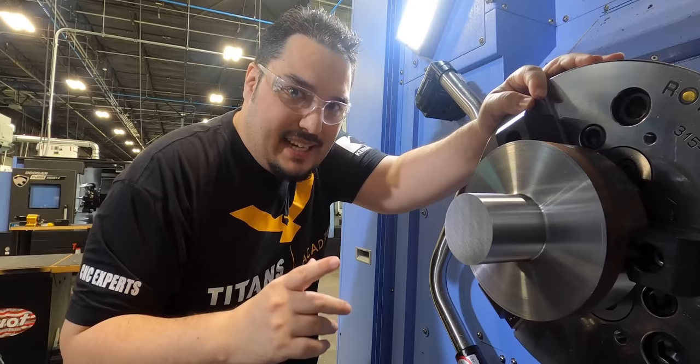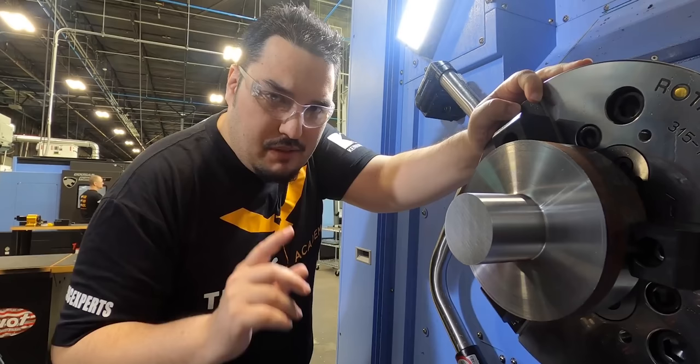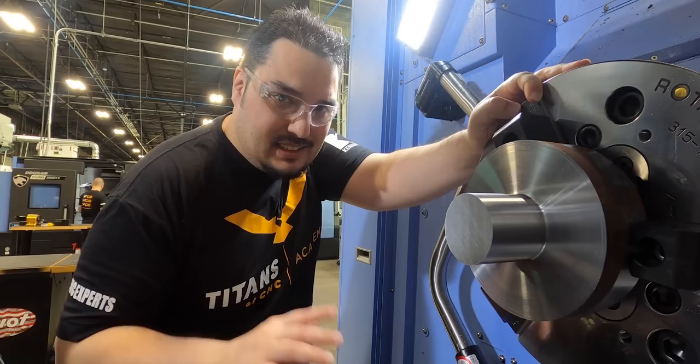Awesome. I was talking to my dad and he wants me to do one more cut. I wasn't planning on doing it. And I'm gonna crank up the SFM to 1,000 and I'm gonna crank up the feed rate from 20 thousandths per revolution to 24 thousandths. That's insane. I'm actually kind of worried if the tool can do it or not. I really hope that this works.